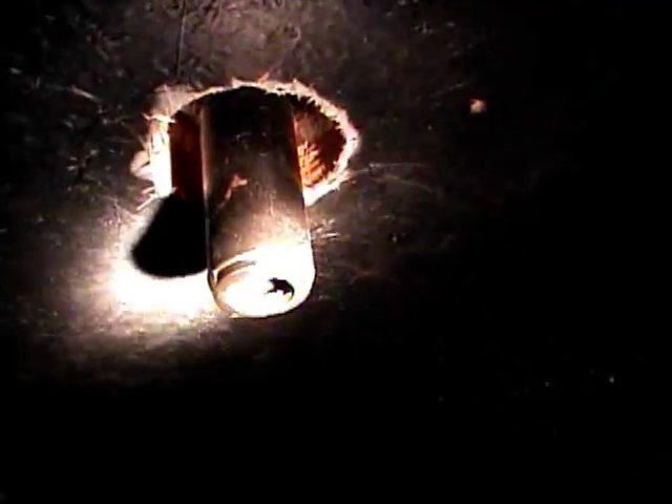Now we're inside the boat. You can see right there is the pedestal coming through, and right here is the wire I'm referring to. You can see all the way to the front of the boat what's actually under this deck. What I've got to do is remove this screw here and this screw here, and drop this wire down out of the way — it should be far enough forward that it won't interfere. If it would interfere, I would cut this wire and splice it longer to move it back further where it would clear the tray.